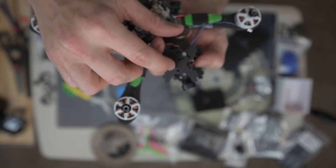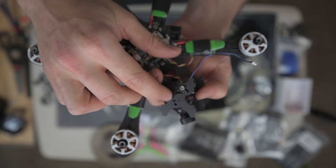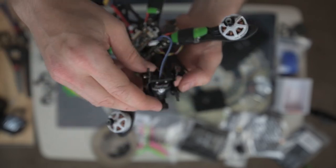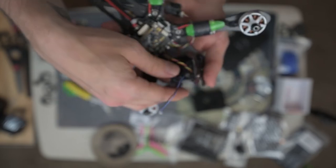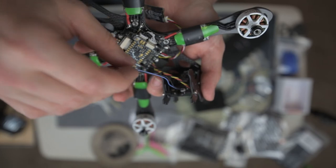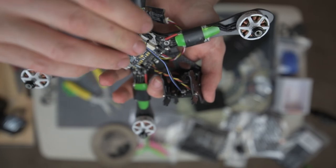5 back, and then on the back side of that, the U insert, whatever you want to call it. Then in the back of the camera, you want to insert these guys. The RunCam comes with 2 of these blue and black wires. You want to make sure you have the female one plugged in, not this one that I did. So make sure you do the other one.